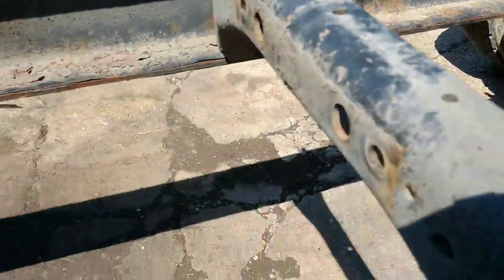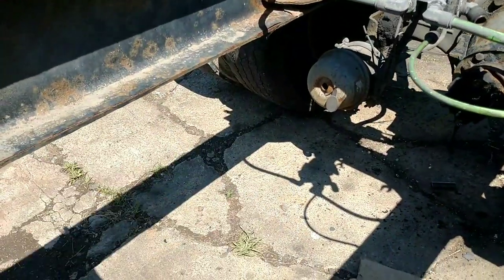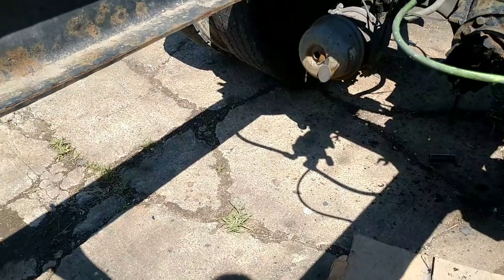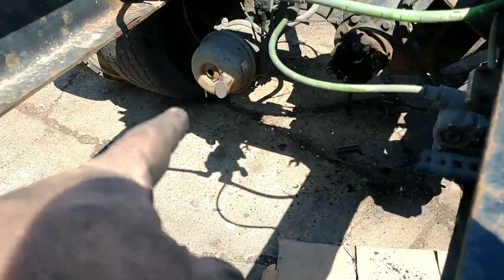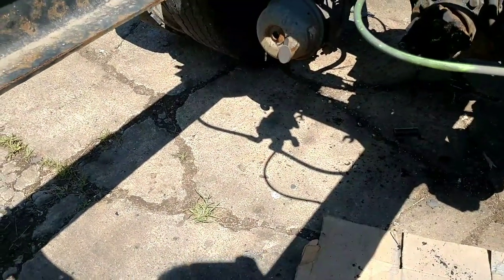All right, we got the drive shaft out. That section up there stays. Now, in this truck's life, and what's the miles on this? 260, 270, something like that. Somewhere in there, the truck had been towed. So when they tow it, they'll cage the brakes, which is why the one brake chamber is probably open, and they remove the rear drive shaft so it doesn't spin the transmission.